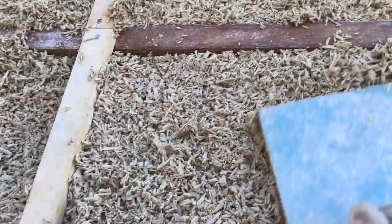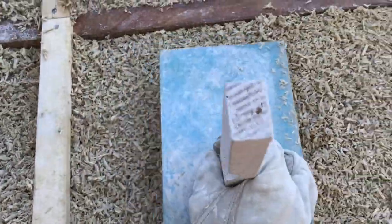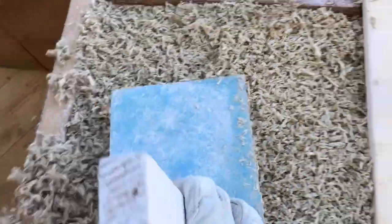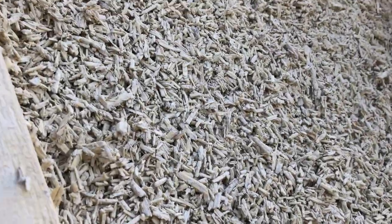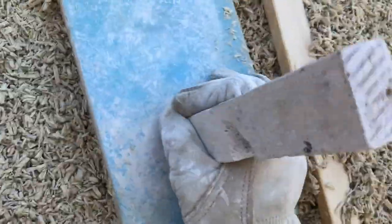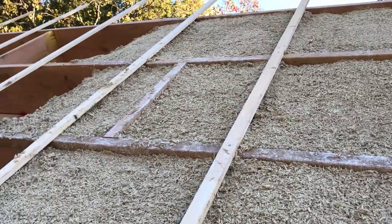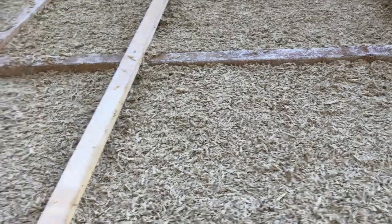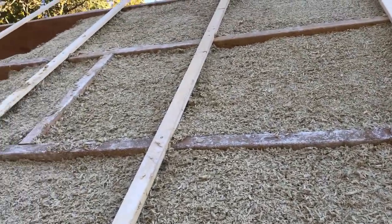So this is doing the roof. What happens is you just screed this off — screed it off and then give it a pack once you arrive. It doesn't have to be compacted too much — a nice light tamping. And then these furring strips here are to ensure that we have an air gap on top of, or below, our sheathing which is going on top of this for earthquake resistance. It's very lightly tamped — not much at all. We leave little gaps just to make sure it's not ever going to be touching the sheathing. Always go just below your roof line and then you're good.